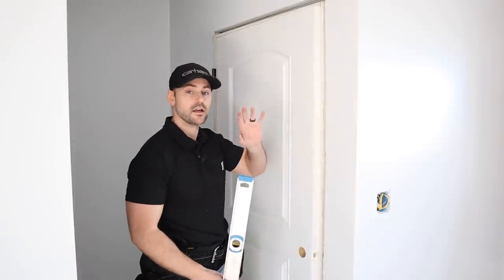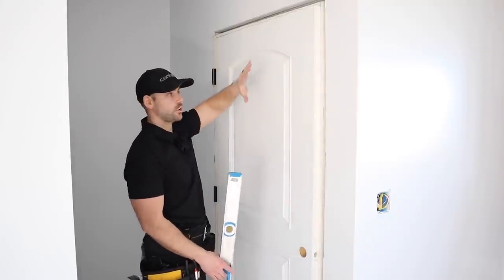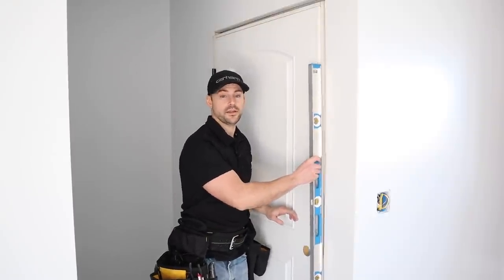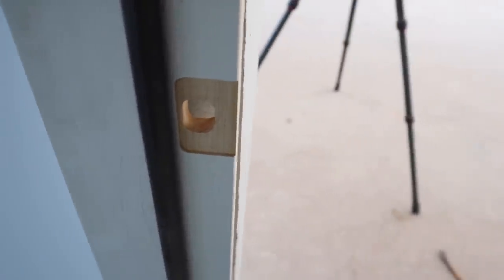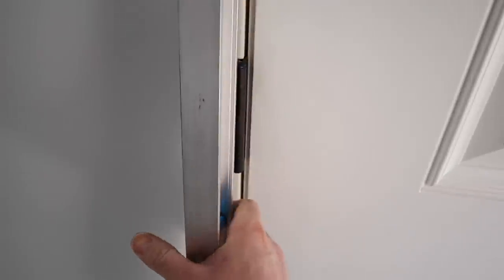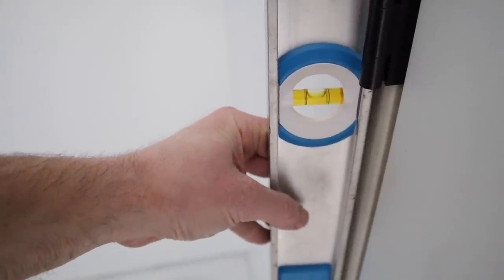At this stage we have a finish nail anchoring the top right corner, a screw in the top left hinge, and the bottom is adjustable in and out for plumb. Checking with the level — we're flush with the drywall, and that looks really good. Checking the other side the same way — flush with the drywall and plumb. The importance of framing a house correctly is that if your wall is plumb, your door will be plumb. Now all we have to do is put screws in the bottom hinge and the middle hinge.